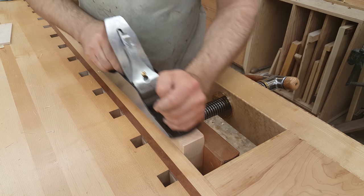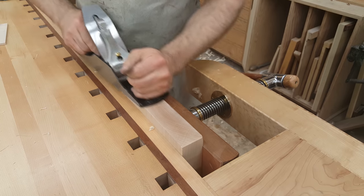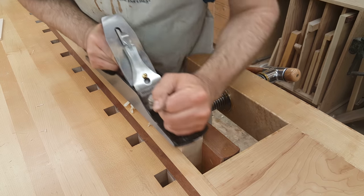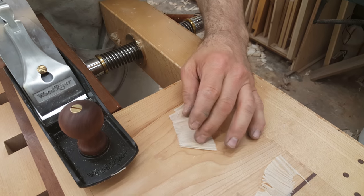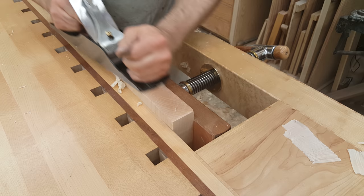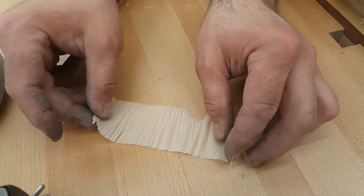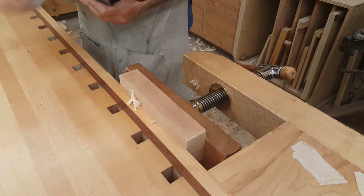It's one of the big advantages to using a bevel down plane, particularly if you're trying to pre-finish pieces and avoid sanding. Now I want to watch to see where the first bit of shaving comes in — it's coming pretty much in the middle of the plane. So that means my blade, if it isn't perfectly parallel to the sole, it's really close. I'm going to advance the blade a little bit more so we can get a little thicker shaving. This is what you can expect using a standard bench plane on end grain, and if you come over here and inspect the surface, it looks pretty good.